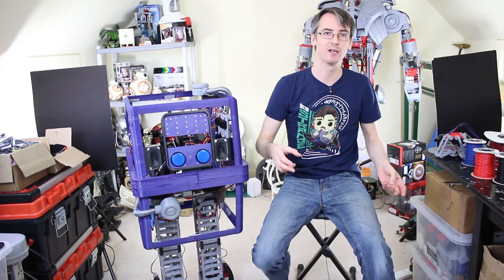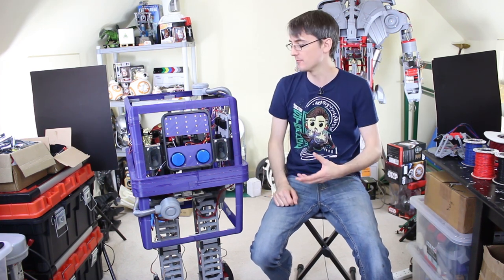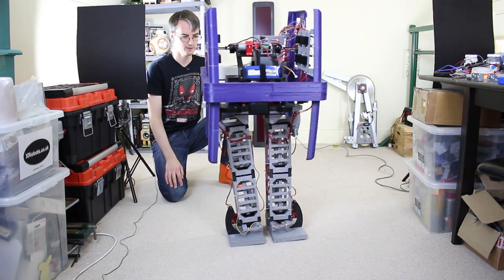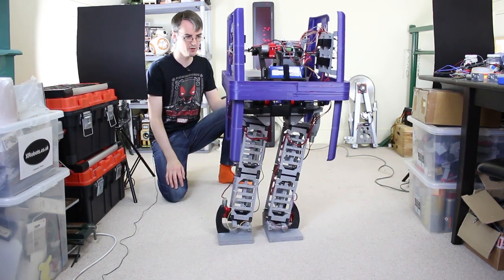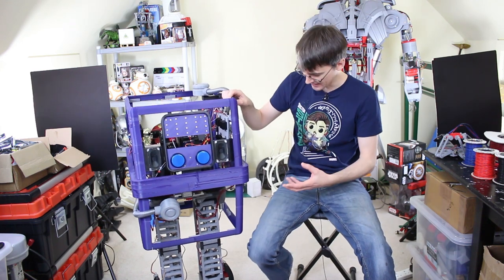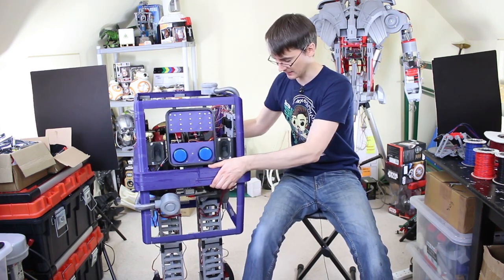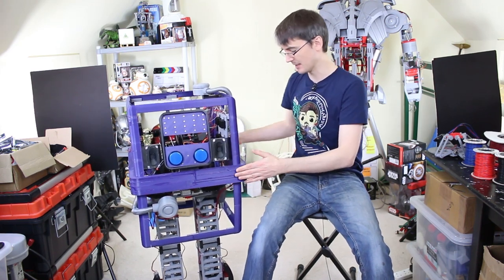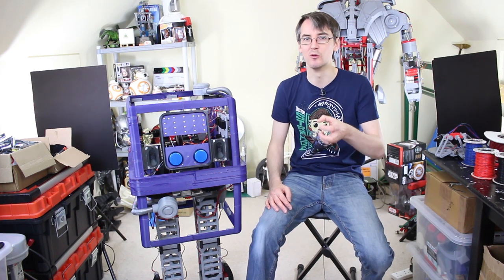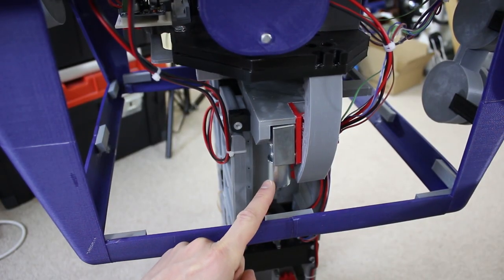So what's the future for this project? What I had in mind when I started was that the mechanism was pretty good, rigid and controllable, and the motors were strong enough. But as the series has progressed and I've put more mass on, we saw where I tried to get it to preemptively shift mass side to side - it's quite wobbly. A lot of that is backlash in the gearboxes, and there is some bend in the plastic. My motors aren't really powerful enough either - it's only on the edge of working, and if I run it for too long the motors get that warm motor smell, which is the enamel melting on the windings.